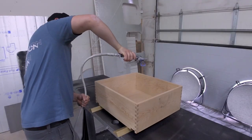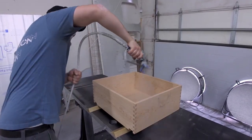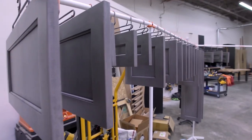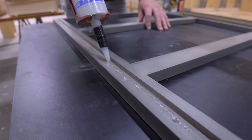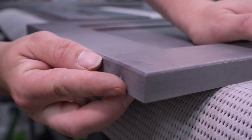The drawers also get two coats of the clear, but no color. Cody did an absolutely wonderful job. Now the face frames can be siliconed on with their pocket hole screws as clamps. Any holes in the bottoms of the doors can be filled with gray wax.